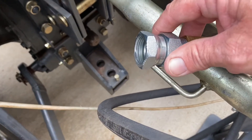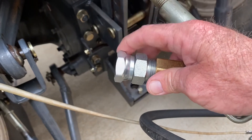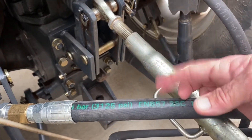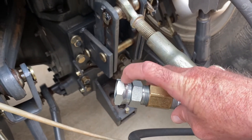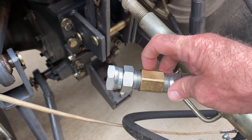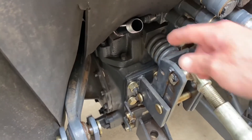On the other end will be female, and it will have SAE threads on it — just a standard three-quarter inch opening that you can get any type of nipple from your big box stores and just screw it right in. Your hydraulic line, in a lot of cases, may screw directly into it, but you do have to have that fitting to get it to screw into your tractor. You're also going to have to go to your tractor supply and get a swivel. If you don't get that swivel, you're not going to be able to get this onto your tractor, because the hose is just going to spin and get into a big knot — you'll never get it tight. Shaver is not going to give you this; you'll have to go to your local tractor supply store and get a nipple in the right size for your application, and it will screw directly onto your fitting from Shaver.